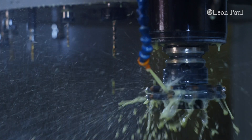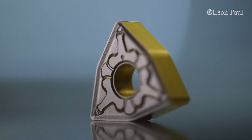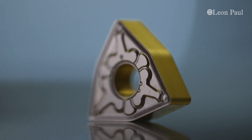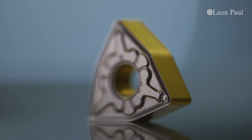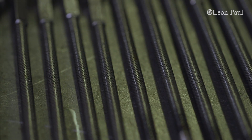To get the precision and repeatability that we wanted, we had to move away from the grinding process that all other manufacturers use. So we actually mill these blades rather than grinding them. By cutting away the steel with precision tooling, we're able to get the blades to a much better tolerance. This means that there's almost no variation between blades, which essentially puts an end to the need to go through a whole batch of blades picking out one that's good for you, because you can be absolutely sure that when you buy a blade, it's going to be exactly the same as the last one.